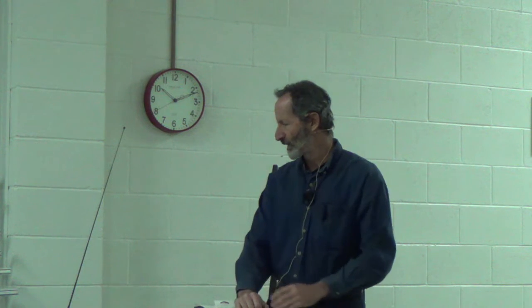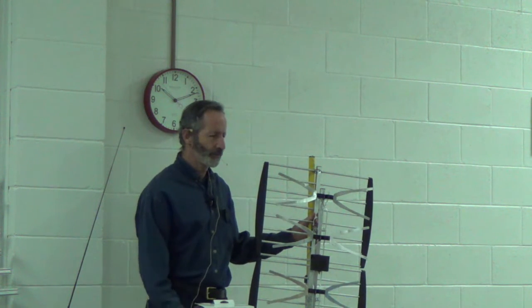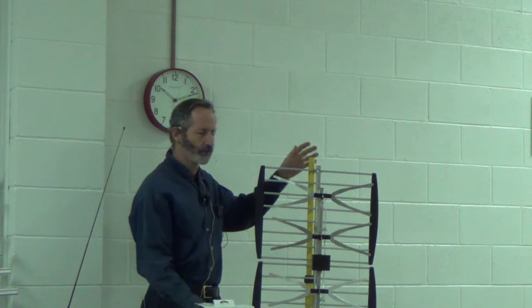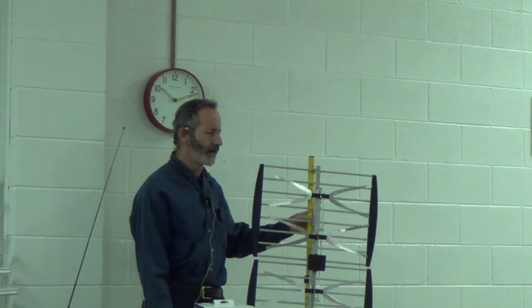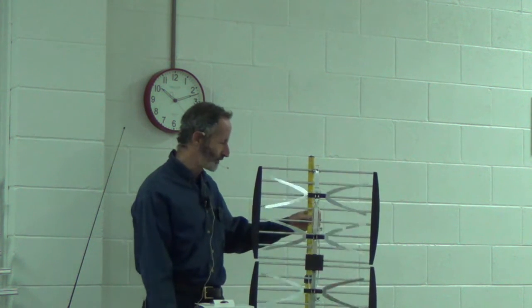I've been making a map of where the signals are strongest, and I found there are certain areas in Grants Pass where you get a real strong signal. They're all on the UHF frequency, so you don't need to put up a big monstrosity of an antenna. From about the fairgrounds way down Redwood Avenue or along the river, we usually do pretty well with a UHF antenna like this. They have some with a lower profile or less of an eyesore, which is an asset if you're in a trailer park where they don't allow antennas.